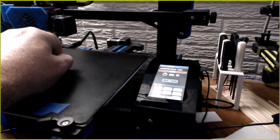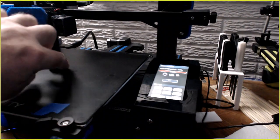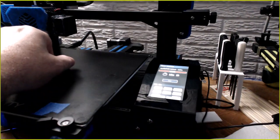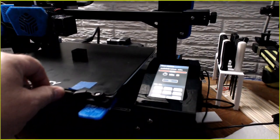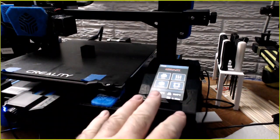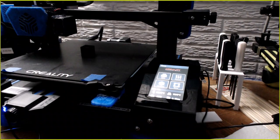But yeah, the cube printed. I'm not going to pull it off. It's still hot. Edges are very smooth. Yeah, it prints nice for me. I know other people were saying they're having issues. And now we can push exit, wait for it to cool off, then we can turn the power off. I don't like to turn it off with the hot end still that hot. I like to let it cool off first. So I will play with the firmware files and see if I can find a way to extract them, and then just change the silly color. That's all I want.